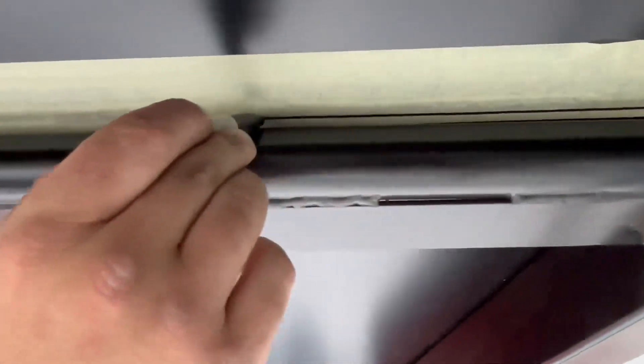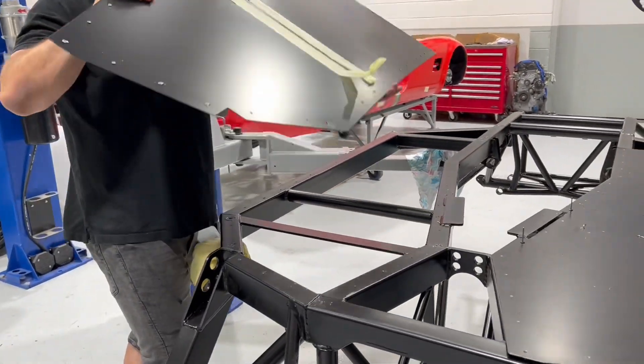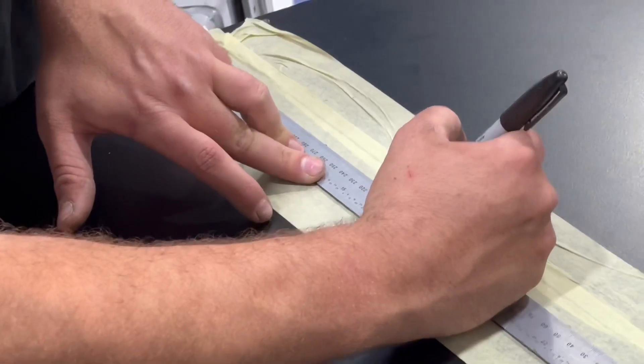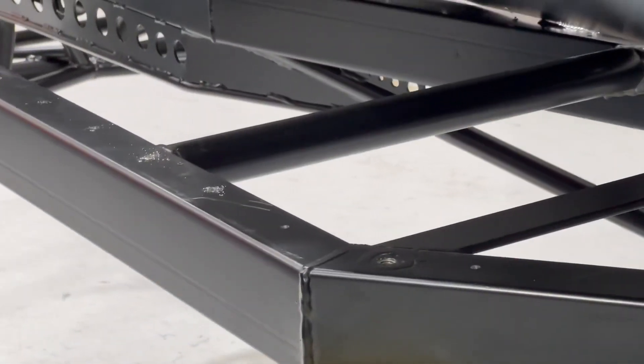Now to mark the seat tubes, put tape on the inside of the floor and mark with a pen. Fold the floor pan over and put tape in the middle. You're then going to find the centre line between those two lines. Mark that up and carefully measure, and that will give you the precise centre line of your tube.